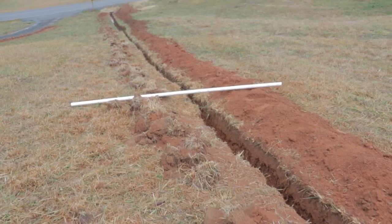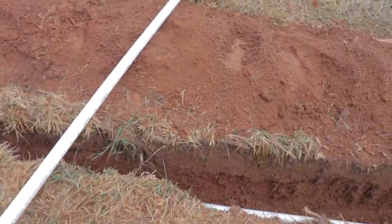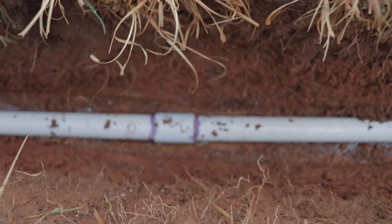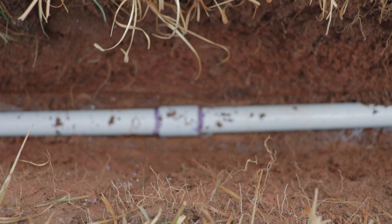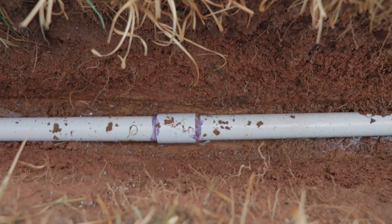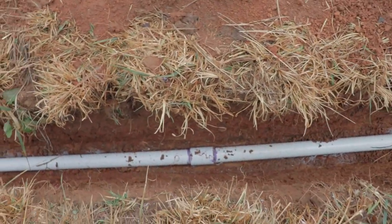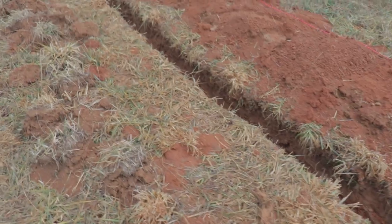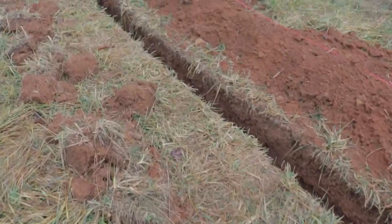The water main is actually three-quarter inch. Let me check this again — this is where my pipe separated last night. What happened was it was really tight in here and things weren't aligned very well. I couldn't get both pieces fully pushed together or twist the pipes, so they had a really weak bond. But I guess I got that fixed.